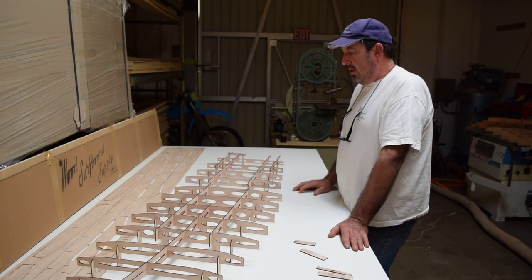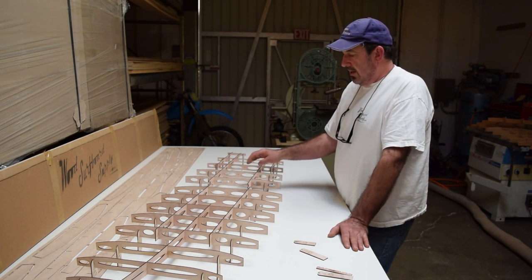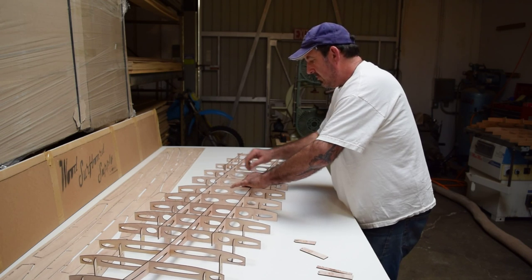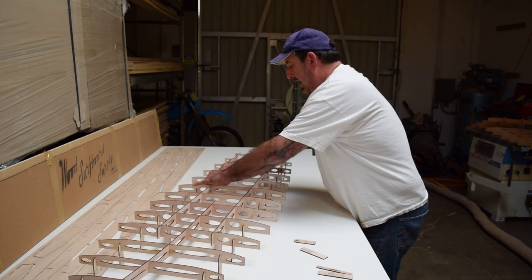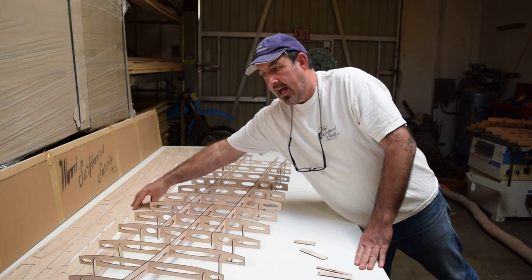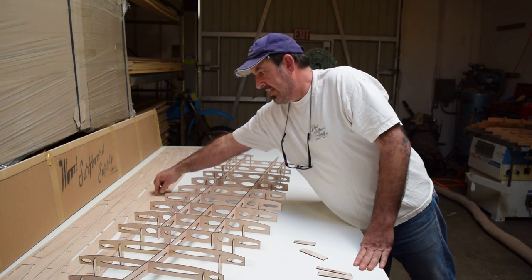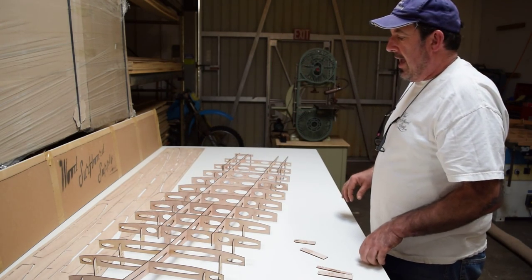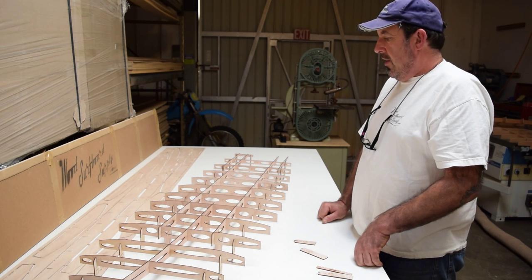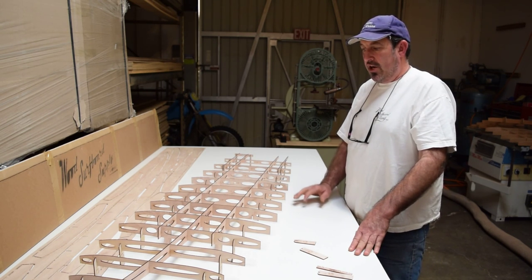For kits designed to go internationally, we've taken all the long pieces where they've been cut and instead of asking the builder to put gussets in, we've now dovetailed them — which is a very nice feature. Finally, these generation 2 frame kits are laser cut rather than CNC cut. CNC cutting with a router bit can leave a little fuzziness, whereas laser cutting is absolutely precise. Those are the main differences between a generation 1 frame kit and a generation 2.